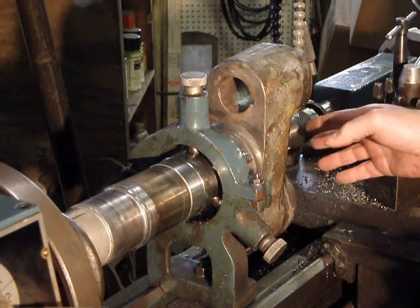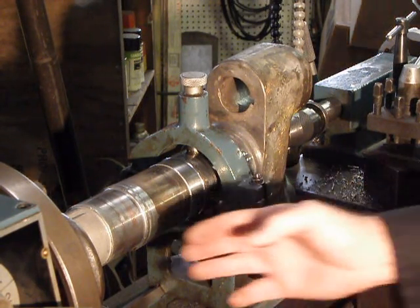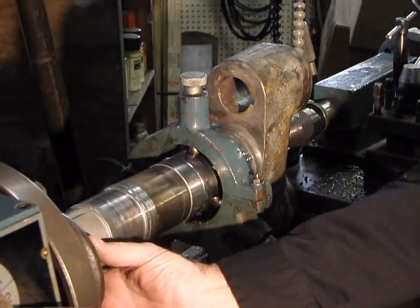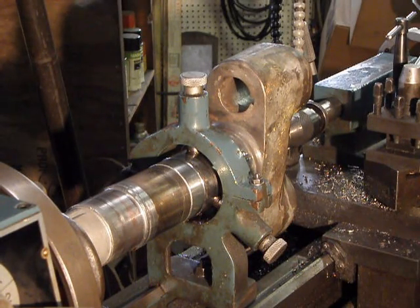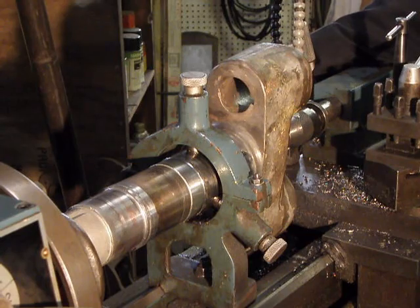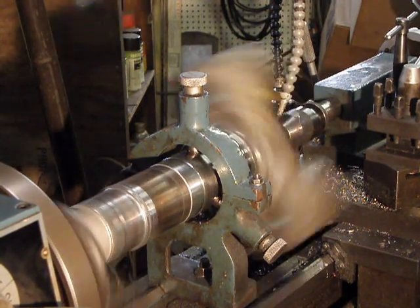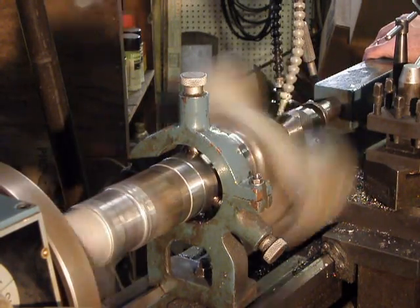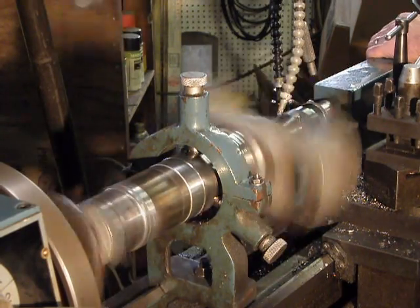It will work around and finally find its way to center and work very well. I also don't have the lathe dog back here pulled back. They used to use devices that would pull it back against the face plate, but when you've got a center here, it really doesn't — it's not going to come off there. So we'll just turn it off. The center just kind of pushes up against it and then they just go to work on it.